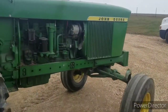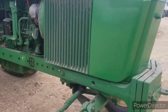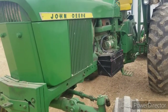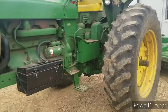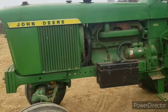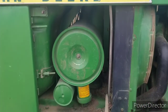I think they're about 10 inches longer — either that or the wheelbase is 10 inches longer. They've got a bigger radiator. They've got piston squirters on the bottom of the piston — all things that were done to this tractor by John Deere to keep it cool and make it last. You can have all the horsepower in the world, but if you've got to rebuild it every thousand hours, it's not good for much. So they didn't just put a turbo on it and turn it up. The radiator's bigger, the air cleaner's bigger — actually, the air cleaner's a little bit different than on the 4020. I like it a lot better; it's turned sideways.